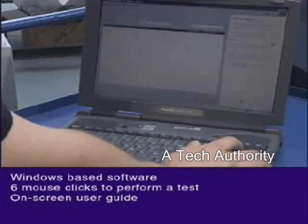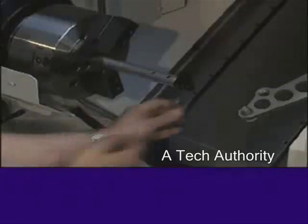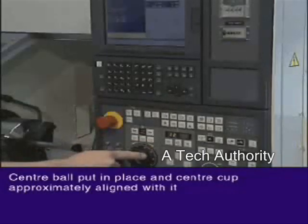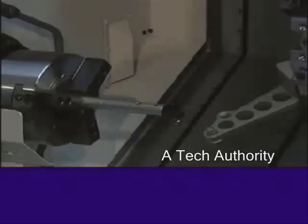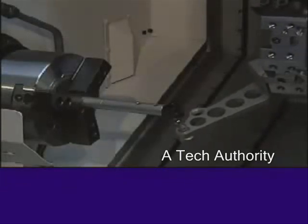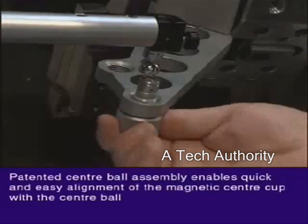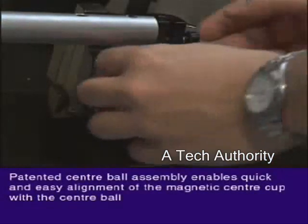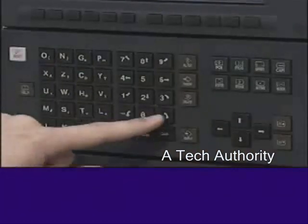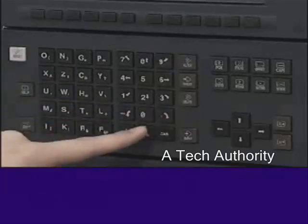On-screen graphics guide the user through the process. With the center ball in place, the adapter arm is moved to enable approximate alignment of the center cup and ball. Renishaw's patented design enables quick and easy alignment of the magnetic center cup with the center ball. A G54 offset is then set in the controller to record this position as the XYZ0 position.